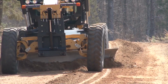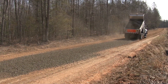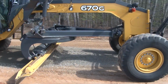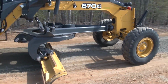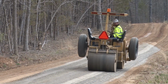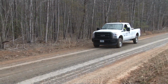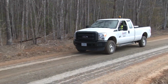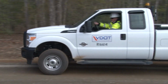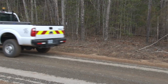After shaping, add surface gravel to areas where base materials, clay, or surface pumping is visible. Shape, add water if necessary, compact to a 4% crown, and match driveways and intersections. When the work is done, the supervisor or experienced operator should do a visual inspection and, if necessary, make any needed adjustments to high or low areas in the crown.